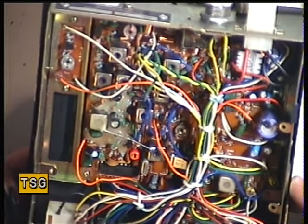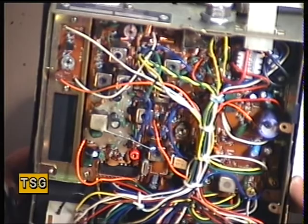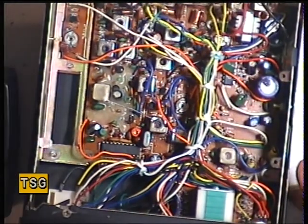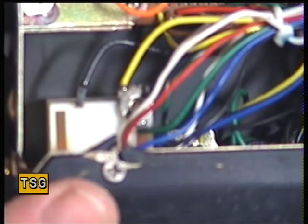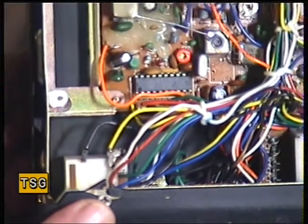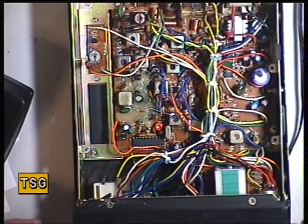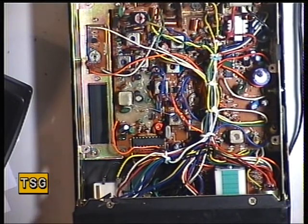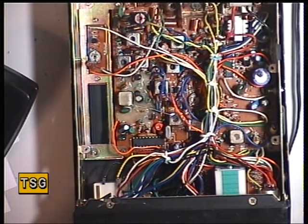It's reading about 10 now. Some S-meters are adjustable on Maxcoms and some aren't. If fitted - where is it? I'll just show you where it is. I've been able to adjust it - it's tacked on the back of the meter, just there, that's the one. Set that for S9. As you're aware, some Maxcom chassis have an S-meter adjustment and some of the earlier ones don't, and the meters can be a bit on the lazy side. Clearly they rectified that later on in production.